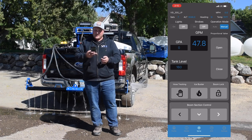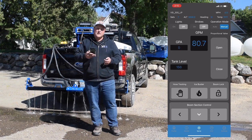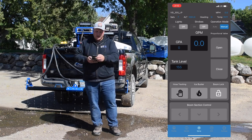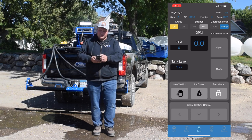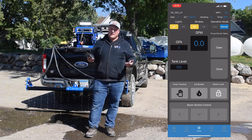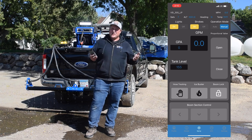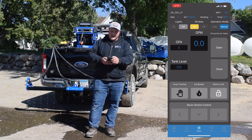You can see they light up as you click on them or turn them off. If you're driving down the road and you don't want your booms to work, you can turn on your boom lock — now nothing works. You can also control your work light and your strobes independently. We got feedback that people wanted to control those separately because they want to drive down the road with their strobes but not their work light, so now we can do that.